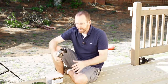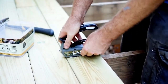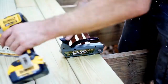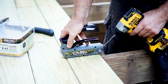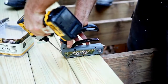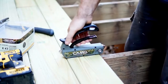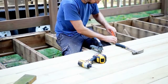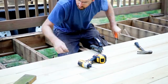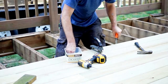What this system does is take a different approach. Instead of driving the screws directly through the top, you use this tool to drive the screws in at an angle on the edges of the board. By doing so, it can use a much smaller screw. Normally the screw head is what stops the board from coming up, but when screws are driven at an angle, the screw itself stops the board. So the head on these screws is much, much smaller. By driving the screws through the edges, you're not really seeing them — they're almost invisible, which gives a much cleaner look on your deck.